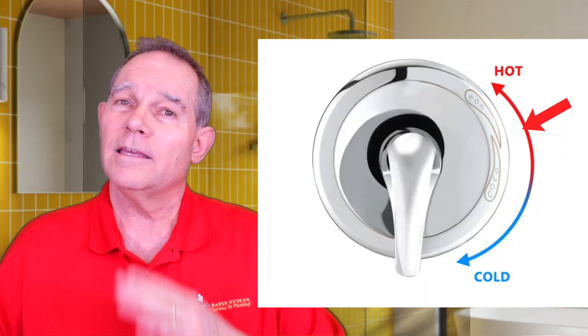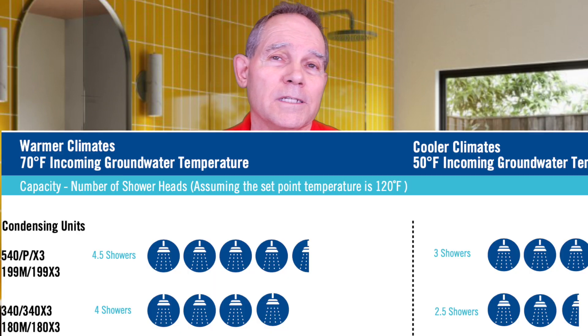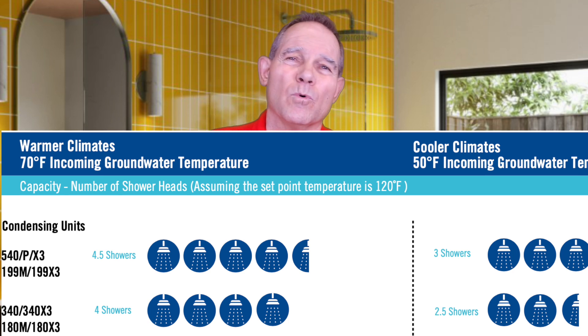You may need to turn your shower handle a little more toward hot than you're used to, since tankless runs at lower temperatures. Also, with tankless you may not be able to run a bath and a shower simultaneously, but you can fill the bathtub and then take two, three, or four showers in a row — you'll never run out of hot water. With a 10-gallon-per-minute tankless you can run two to three showers at one time. The bathtub and washing machine are the only fixtures that really affect flow.